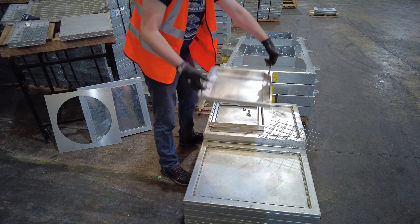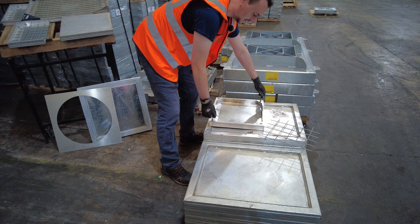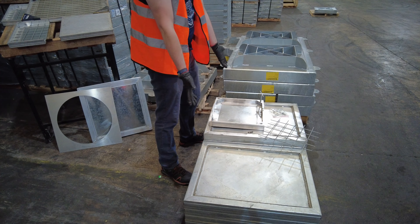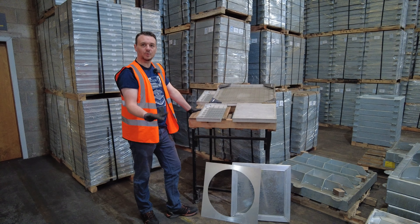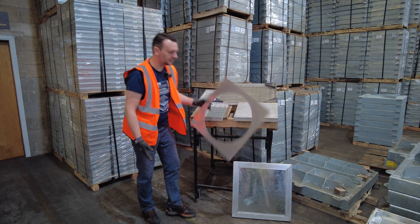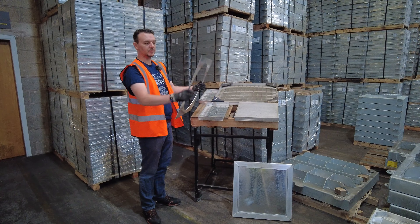Lift-out aluminium, lightweight — goes straight in, keys out, bolts in, and you're ready to go, ready for infill. Depths vary from 27mm to 58mm depending on your infill — your slab, block, or whatever you want to put in the tray. We also have a square-to-round reducer connector.